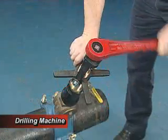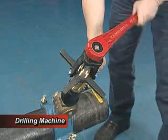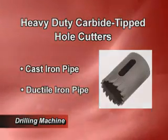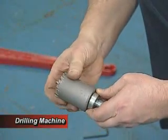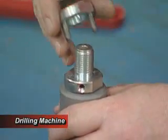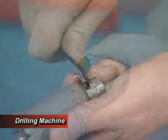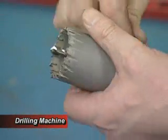This demonstration is shown using a two inch heavy duty hole cutter with a Mueller 110 compression fitting. Heavy duty carbide tipped hole cutters are recommended for cast and ductile iron pipe. Insert the pilot drill into the arbor body. Screw the hole cutter onto the arbor body and align the holes after hand tightening. Assemble the driver into the body and hole cutter. Line up the flat in the drill with the set screw and tighten with the hex key wrench provided, allowing a maximum of one-quarter inch of the drill tip to protrude from the hole cutter.